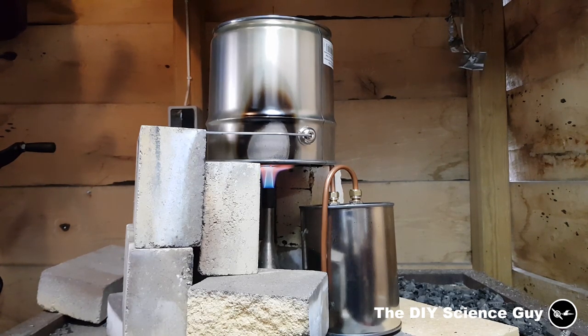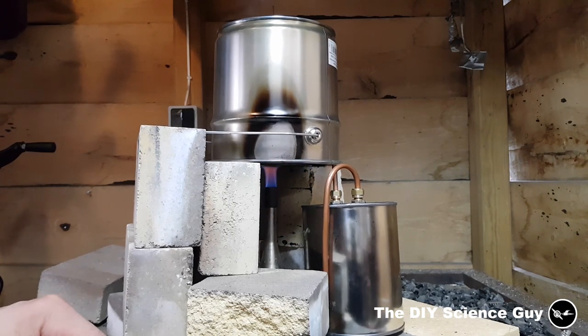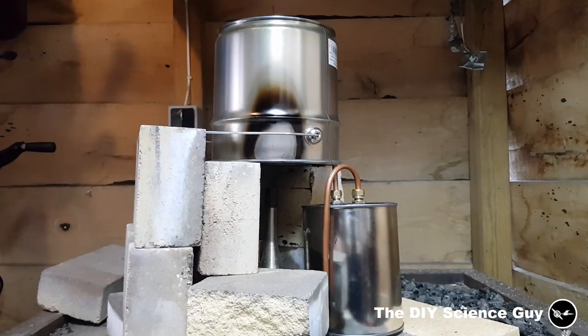I think now it's time to scale it up to make a bigger unit and see how that goes. Just let it burn — you can hear now that it's escalating itself. The can will pop in a few seconds, I think. It's really amazing how well this works. You can see that this moisture is still a problem — it popped again. I need to make some extra separation device or something that just cools this container, because I think that's the problem: this gets so hot that it starts evaporating water again, which goes through the burner and messes with the combustion.